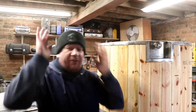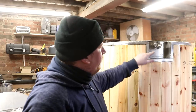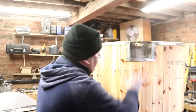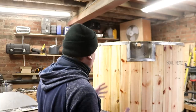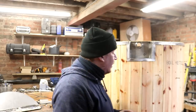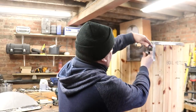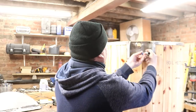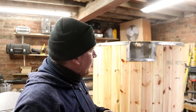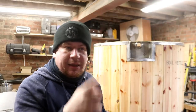Radio off for a little bit of waffle to the camera. Brought the boil kettle into the workshop - it's been a while since it's been in here. I'm going to make a couple of modifications while we've got everything off it and we're doing a little bit of a deep clean on the whole thing. I want to add this lever valve here - this bad boy is going to be fitted onto a threaded socket which we're going to weld here. First we have to cut a wee hole in there and then weld the socket in.